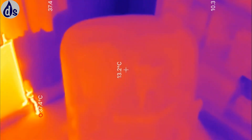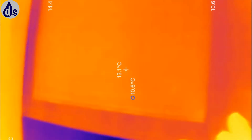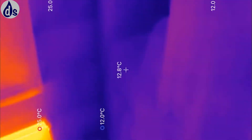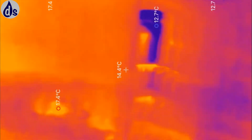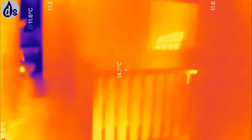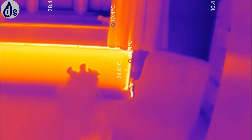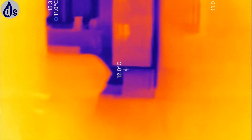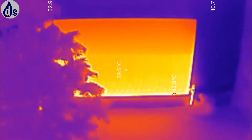Relative humidity is a measure of air's capacity to hold moisture. At 100%, air can no longer hold moisture — that's called the dew point. In summer you can hold lots of moisture, and the dew point at night is when you see dew on the ground outside, which can be as high as 19°C. In winter, the dew point outside will tend to be about 5 or 6°C, maybe 12°C if it's raining. What you want to do is keep the internal ventilation working to bring the internal dew point down and keep the walls nice and warm.